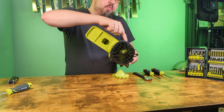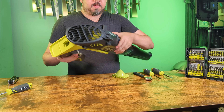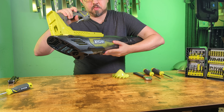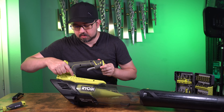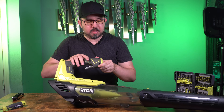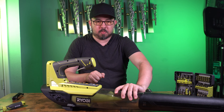There's one, two, three, four on this side. Once you remove those four screws that'll pull out. Then on this side there's one screw here. On the other side there's another screw there. The rest of the screws are on this side — we'll be removing this one, this one, and either loosening or removing that one. And that will allow us to spread open this casing on top and pull out the front part of this plastic.